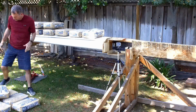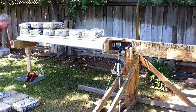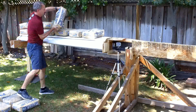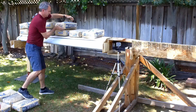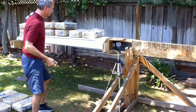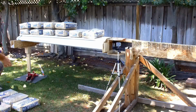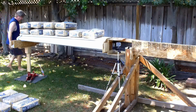Let me see what that takes us up to. I heard a noise. Yeah, I heard a little snick. That's 2 G loading when that one goes on. Where did we hear the little click? In there. That's where the spar repair is on the bottom. Well, we're ready to test it.